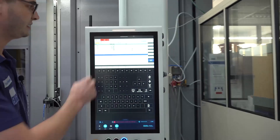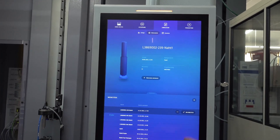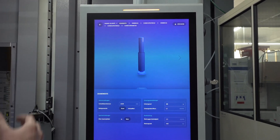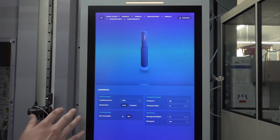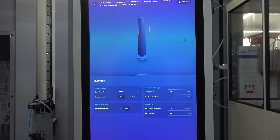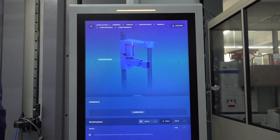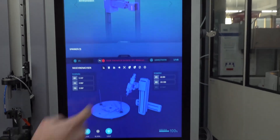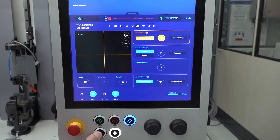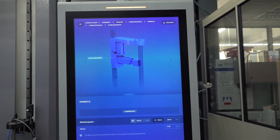To show you how easy it is to set up a new part on our EMAC HMI, I will show you how quick it is. With the edit button, we can select a new workpiece. On the first screen, we have the basic values: the welding parameters such as the welding diameters, the gas type, the gas flow rate, and so on. On the second screen, we have the clamping devices and the clamping positions. On this HMI, we can directly set positions by pressing the plus or minus button, then press teach — and it's already taught.